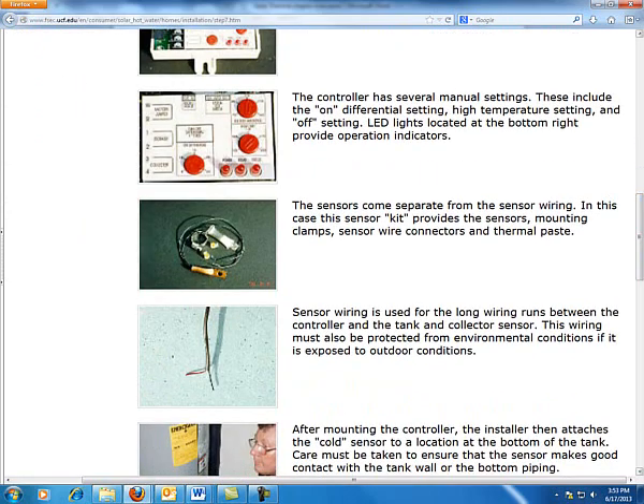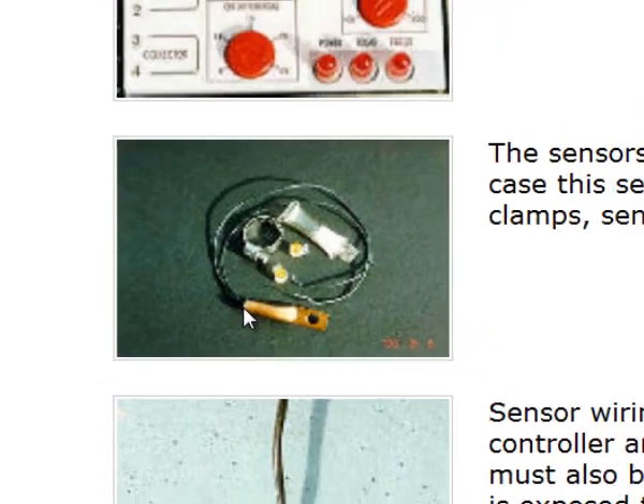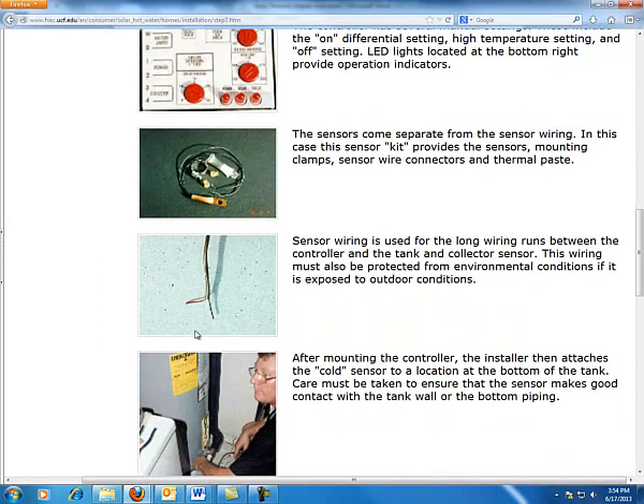What we care most about is the protection of these sensing wires. This thermocoupler is embedded into a copper probe and mounted onto the solar collector. Over time, that hot-and-cold cycling will cause the junction within the sensor to go bad. So we really need to know how to measure opens, shorts, and resistance of these sensors to make sure they're working properly. The sensor is nothing more than a resistance run through a rather long wire back to your controller.